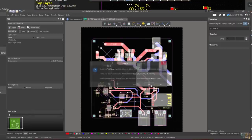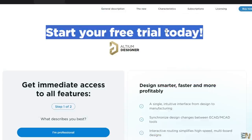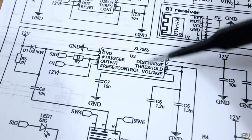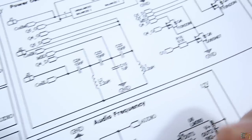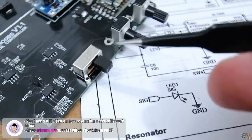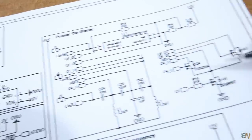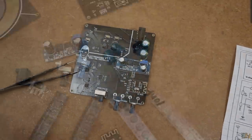I check the rules and export the files for PCB manufacture. If you want to try Altium Designer, you have a link below in the description. So now we know the schematic and have the PCBs. Here is how it works: the 555 timer creates the pulses and we apply those pulses to the second timer, which applies the pulses to the oscillator. The oscillator is made out of two coils and two capacitors. To control the firing pulses power we have two MOSFETs, and this will resonate. Using the switch, we can change from the 555 timer to the Bluetooth music receiver. This applies its signal to an operational amplifier and again to the second timer, creating resonance but this time with the music at the same time.